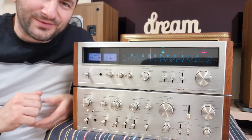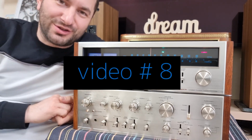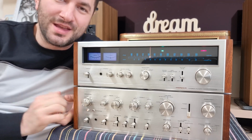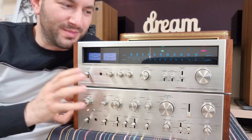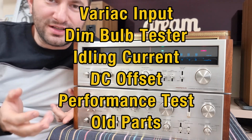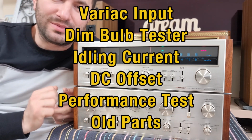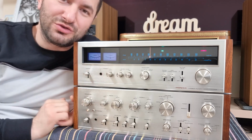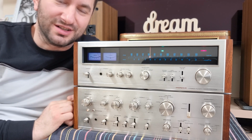Hello guys, welcome back. This is video number 8 of this Pioneer SA9100 full restoration journey. In this video I will show you how to make the first start without any problems. You'll use a Variac and a dim bulb tester, and you have to measure some voltages, but if you want to see, you have to stay tuned and watch the video.